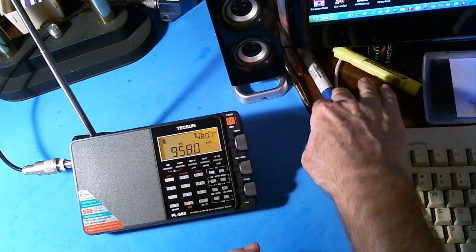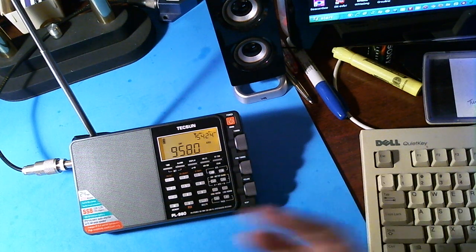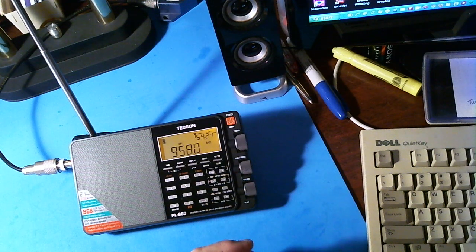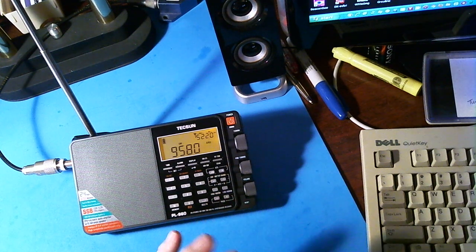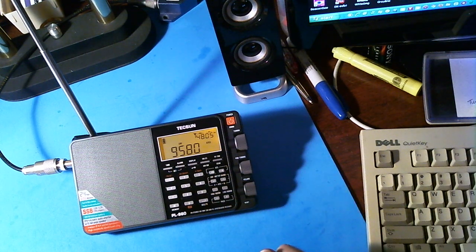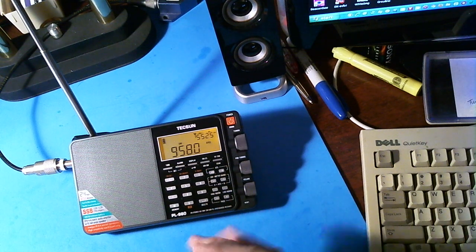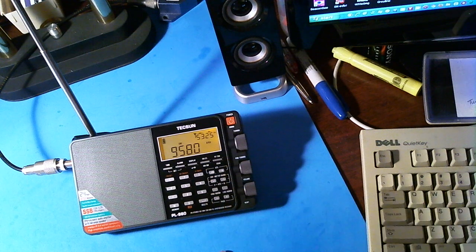And the concept of that circuit is to help the radio when you have a weak station that is fading in and out. And theoretically what it does is it removes the carrier, the RF carrier, and then replaces it with, let me go back a second. The RF carrier is causing this fading in and out. So it replaces that RF carrier with its own carrier, which is strong and stable, and therefore theoretically getting away from that fading.